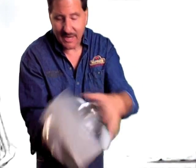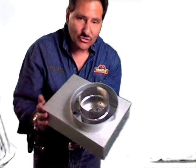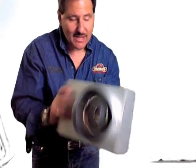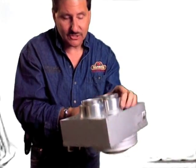You're going to have three-inch lines coming down the chimney. And if you have a system that has a regular direct vent external cap on it and you want to convert it over to this kind of system — where you have two lines, one's the exhaust and one's the intake air going up the chimney — then you can use this device for that. This will fit right onto the back of the stove or right on the top of the insert, and then you run the two lines separate from that.